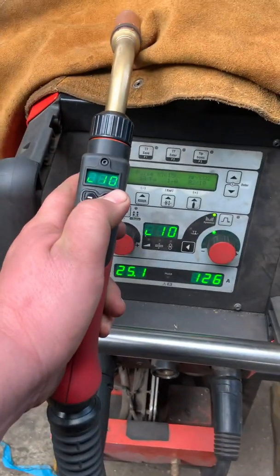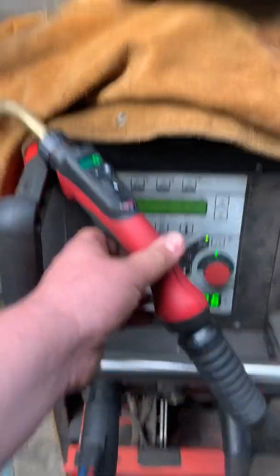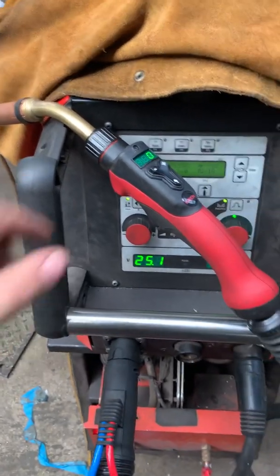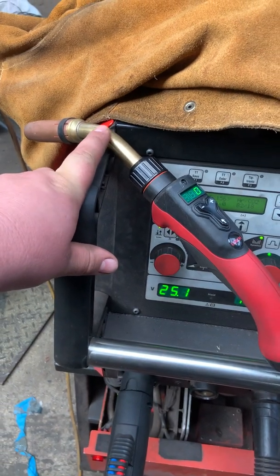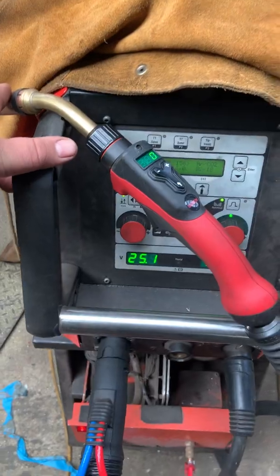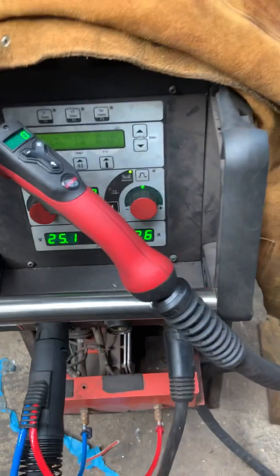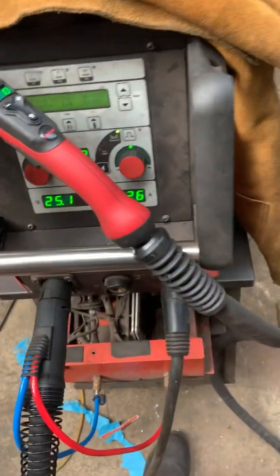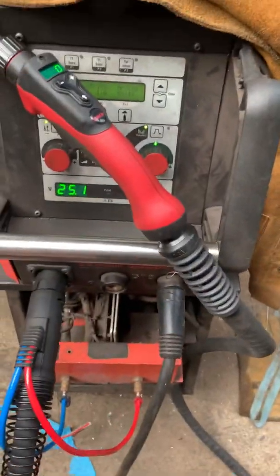It's a good tool and the torch is nice. This is a water-cooled, it's called a 7700. I don't know all the specs on it, it's just what was available. It's got a twist neck — a really heavy duty copper neck — and it's got heavy duty tips and shrouds. I've got it hooked up to my makeshift TIG water cooler which is keeping it cool and doing the job, but I'll probably get the proper Lorch cooler that integrates with the machine so it comes on and off automatically — at the minute you've got to remember to turn this on.